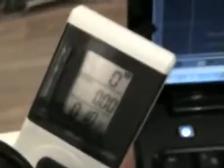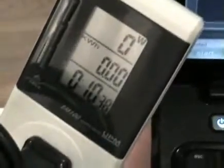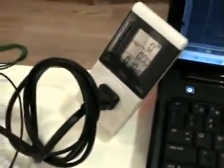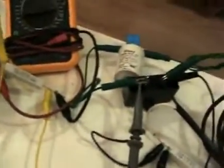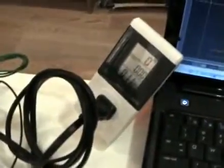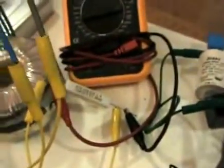All this is working out of reactive power. We've got zero watts going into the circuit, and I promise you this is functioning — this is a brand new meter, there are no defects. If you get your capacitance just right — I've got 15 microfarads here, an 8 microfarad here, and a 0.4 microfarad to fine-tune it — you get the meter to display basically 0 watts, all reactive power, while outputting a total of 10 watts of heat.